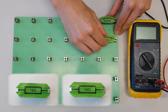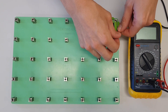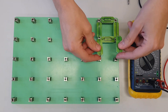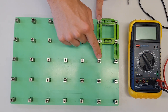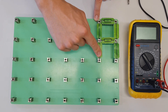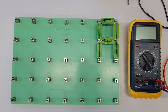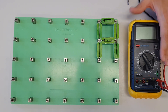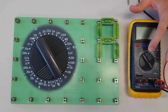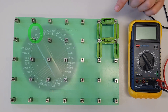And a 10 ohm resistor. We'll connect those together — these are connected in parallel with each other. Where we've got resistors connected in parallel, the current doesn't have to flow through one resistor to get to the next one; it's simply free to go to each resistor independently. We've got our multimeter set up to measure resistance, set to ohms in the 200 ohm range, meaning the maximum we'll measure is 200 ohms.